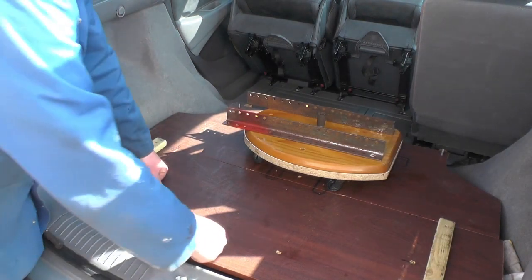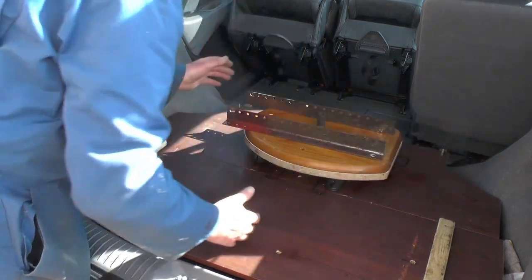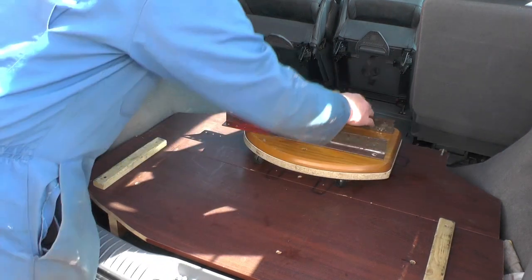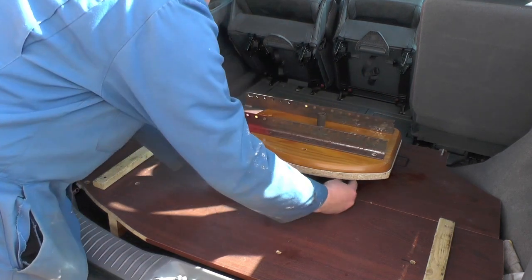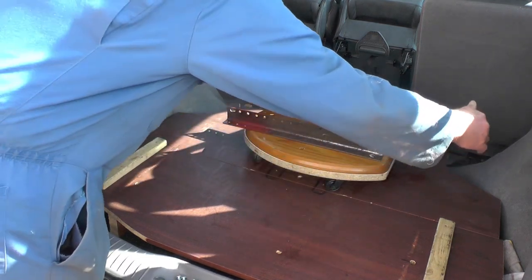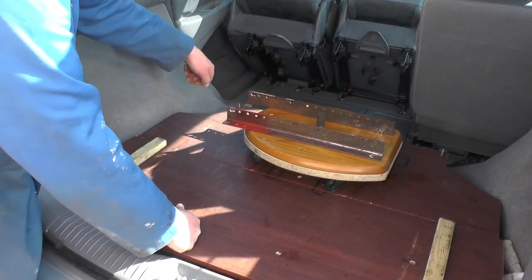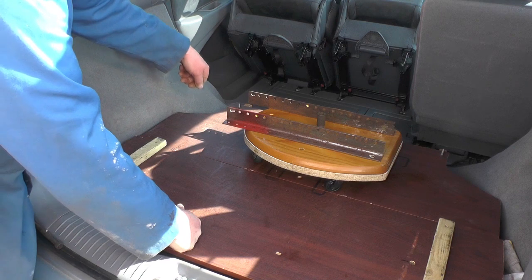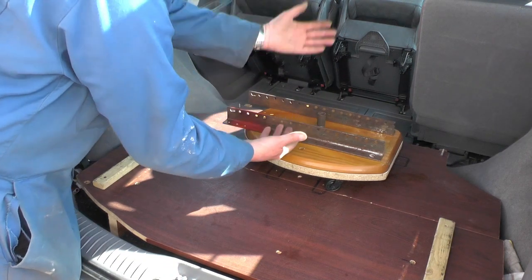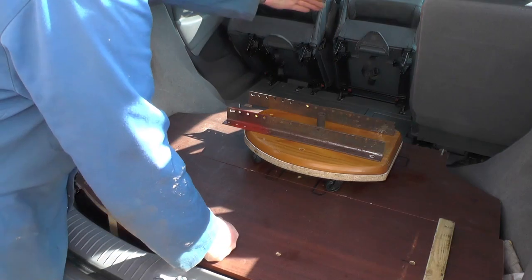Watch this space and I'll show you how I progress. I'm going to put longer pieces of angle on - it's not needed because all the weight is through the three wheels in that position over the casters, centralised on that portion where the wheels are, and it spins really easy. But I'm going to put longer angle in so I can make an arrangement at both ends - put through my coupling rod where the buffers are, put some pins through to stop it moving that way, and to stop it wanting to tilt over in case of sharp braking or whatever.